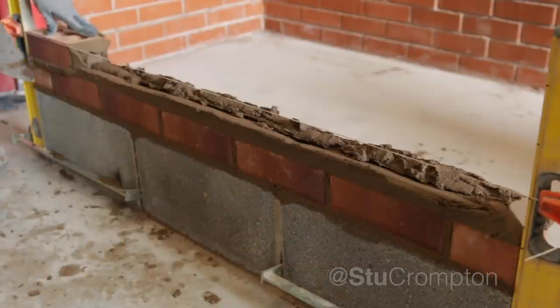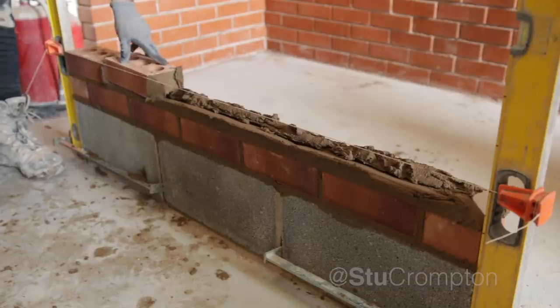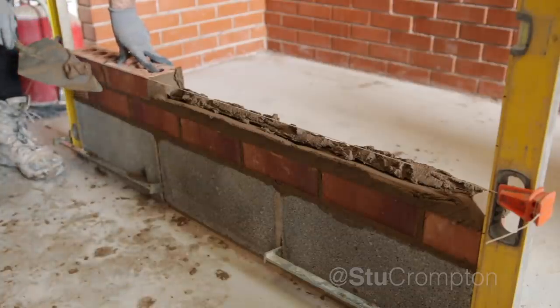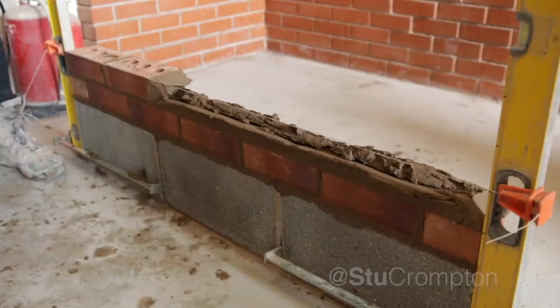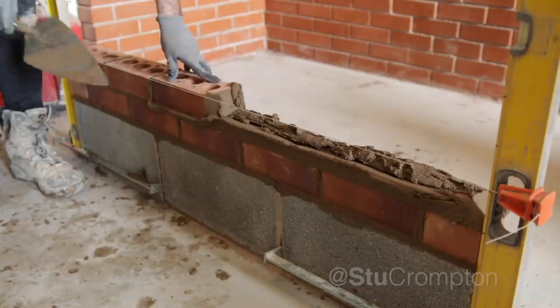Look at the profile, then it's the line — aris to aris, aris to line. Cracking tip that. Give it a little wiggle, gentle pressure down to the line, scraping off your excess. If you need to, get a bit on there — double butter. Even though we're wiggling to place, keep even pressure throughout your brick.